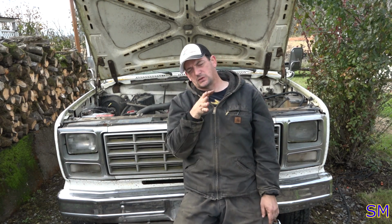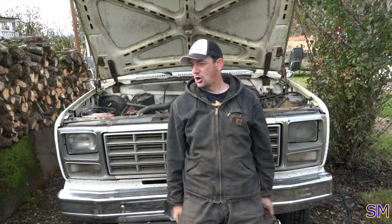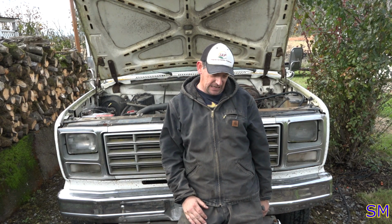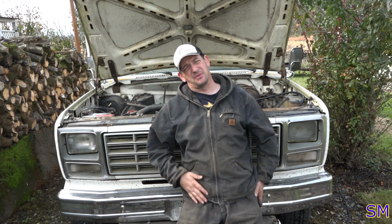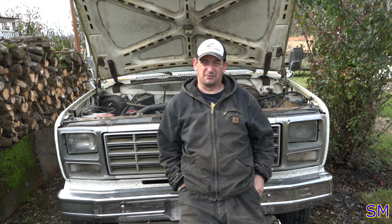So she starts and runs though, and goes a little bit in the driveway until the motor freezes up. So she hasn't frozen up yet, so I might have 5 more minutes of runtime with it. I had plans for it this next summer, early winter now. I still got plans for it. We'll get her going again, but the farmer who I bought it from, he said he ran it up and down the road all over our beautiful creation that we have here. And looking at the rocker arms, they are worn out. This motor's already a worn out girl.